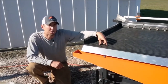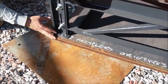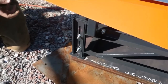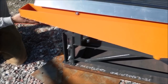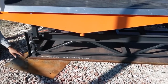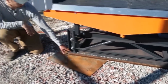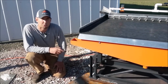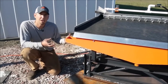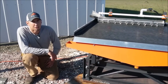Most shaker tables need to be bolted down to a concrete slab, but ours does not. In this situation, we have the shaker table sitting on top of a piece of one inch thick steel plate. All the shaker table needs is enough weight to hold it down so it doesn't vibrate when in operation. This can be accomplished by putting sacks of rocks on the frame — we've seen that done in a lot of rural places, and while we were in Kenya that's how we anchored the shaker table down. You could tack it to a large piece of steel like shown here, or bolt it to a concrete slab if available. There are four holes, one in each foot, that you can anchor bolt to a concrete slab if working inside a warehouse or shop.